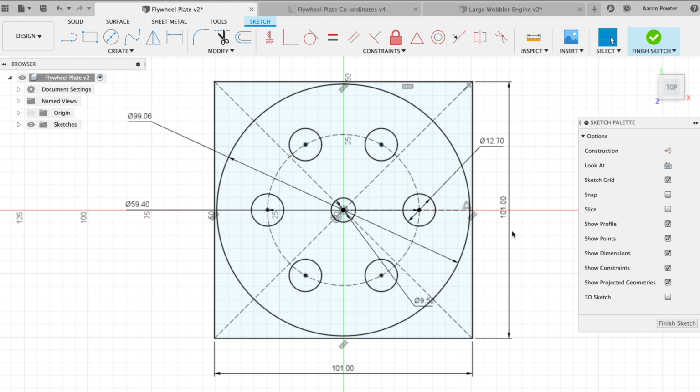As we know, the radius is half the diameter, so therefore, if the diameter goes around 3 times, the radius will go around 6 times. But you have to remember, you can get an induced error there because it's not 100% accurate. Once you find those points of intersection, you can draw a line diagonally to find the top two here.